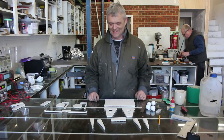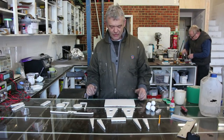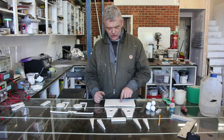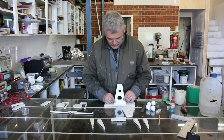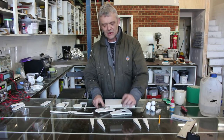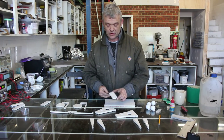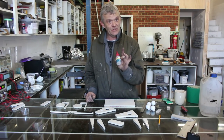That's everything cut out and shaped up. I've drilled some holes and cut things into pretty shapes. Now to put it all together — remember we chose one square manufactured edge, and these uprights need to be in line with each other, otherwise the balance won't work. All measurements are taken from that square edge. I've found the centre, confirmed the correct distance of three centimetres, so I can line those centres up. There are two little marks here which need to align so that the cut in the carriage lines up correctly. The only thing left is to glue the whole thing together — and it glues with this stuff. Let's get gluing.